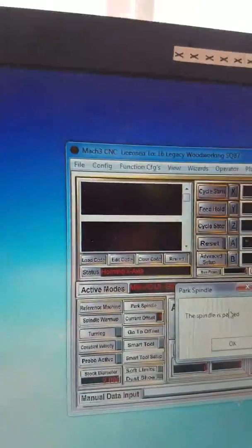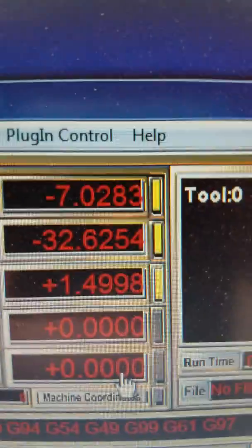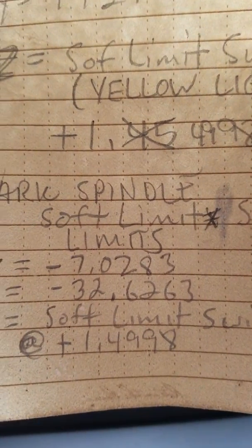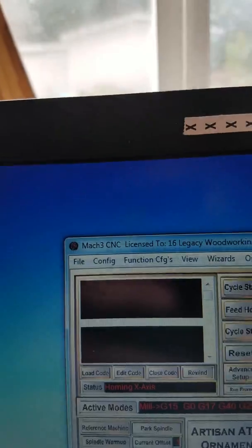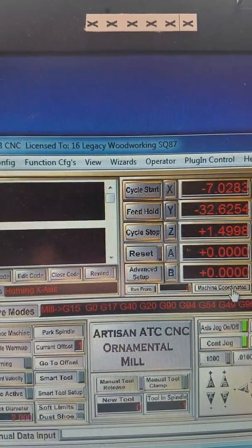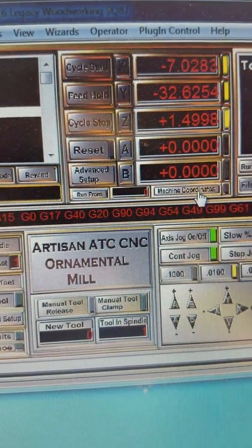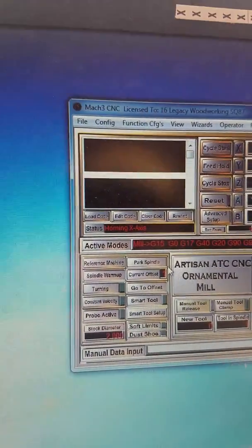So let's park the spindle. It tells us we're parked — we're at roughly 7, 0, 2, 6 or so. I just adjusted that soft limit switch a moment ago because when I parked it previously it kind of rammed home. You can bend down the limit switches to make sure they contact sooner — it's fairly easy but kind of a hassle; you really shouldn't have to.